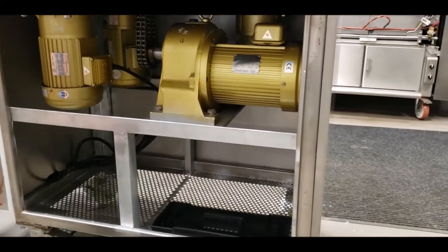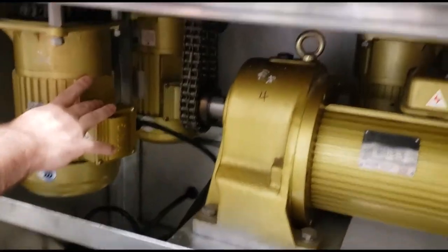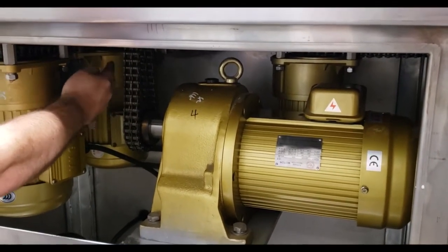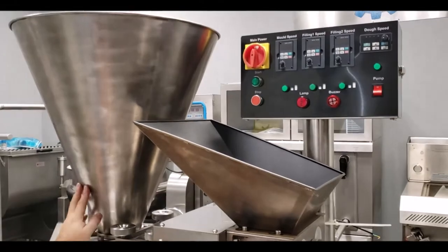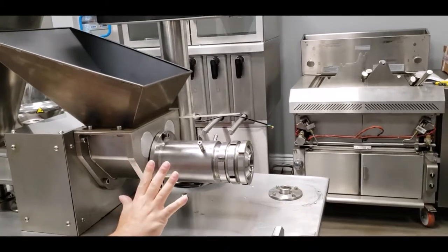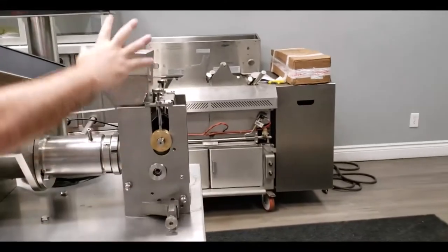Other than that, everything functions very well and they are heavy duty. You have one motor here that operates and controls the second filling device up here. And you will have the secondary motor on the back end that also operates and controls the first filling device over here. The main motor will control and individually operate the midsection of the dough filling head. And this motor on the back controls the mold head and flour motor.